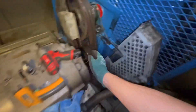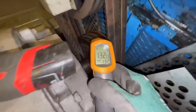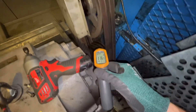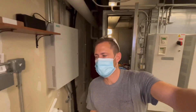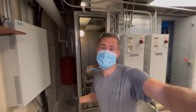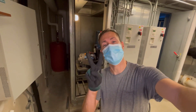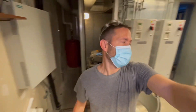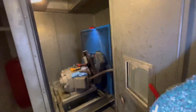My issue: I heard a noise coming from this fan. The belts are actually rather loose for this size motor and the torque it's putting out. Our pulleys are rather warm — they had cooled down a good bit since I opened this up, but these pulleys were at about 155–160°F with the belts slipping. I've got to see if we have a new set of belts on site. Even though that's heavy-grade steel or cast iron, those rubber belts eventually will take that V-pattern shape, lose their grip, and start spinning — losing efficiency and CFM into the space.